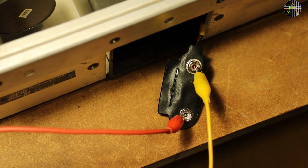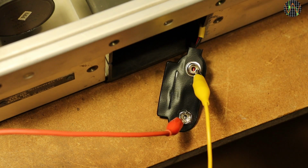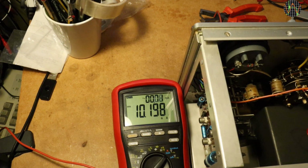The new clip is installed, and I thought I'd just test if it's wired correctly using the bench power supply with the current meter from before still attached. And I was in for a surprise. The previous 3 milliamps is now nearly 6, and some resistance modes draw 36 milliamps. I had not realized how corroded the old connectors were. There must have been quite some contact resistance.